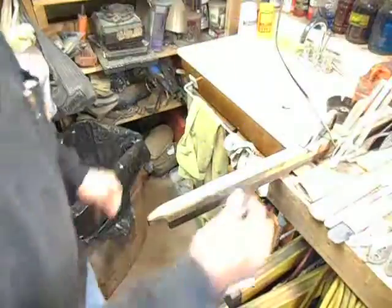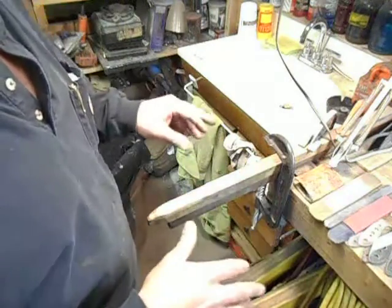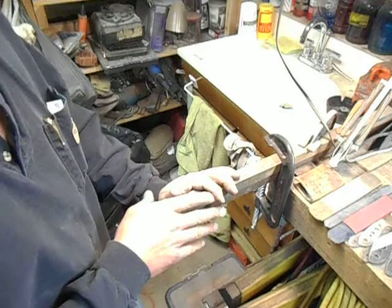Anyway, that was a long story. This is the most dangerous thing in the shop as far as I'm concerned — probably even more dangerous than a buffing wheel, because I don't use a buffing wheel. Now I have another one inch wide stick that will clamp up to this to make sure that the edge of that blade is at the edge of the sanding stick so that can't happen again. So we got safety out of the way, we got the solid bench, we've got the attachment so that we have something to attach it to. Let's go over sandpaper.